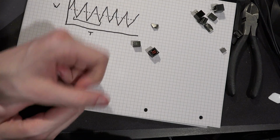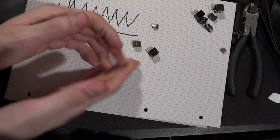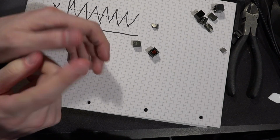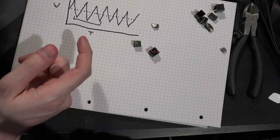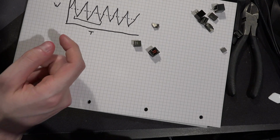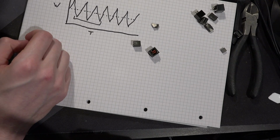That's kind of it. If you want to try and mitigate your coil whine, you're basically going to have to be looking at some kind of adhesive around the inductors. Also, if you're going to be doing that, keep in mind that your MOSFETs don't appreciate being covered in hot glue, because they need to get cooled by something, and hot glue is an insulator.